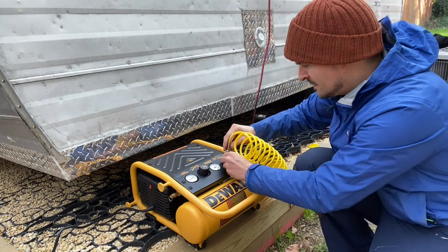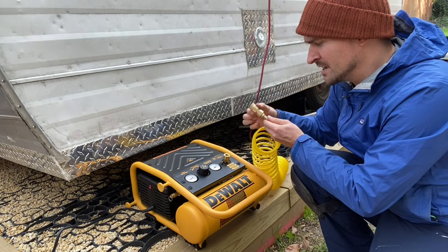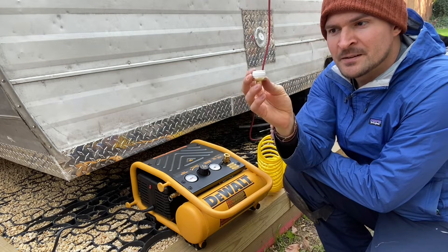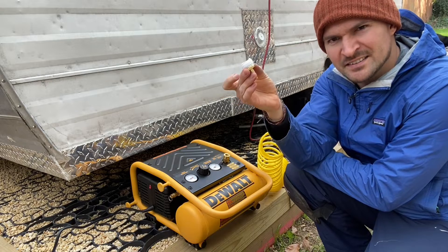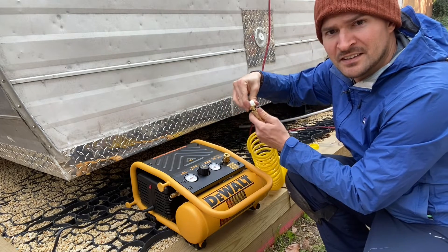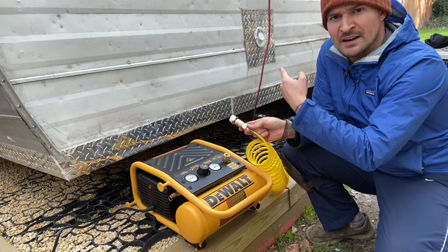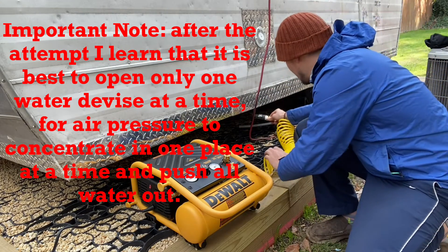The other end of the hose also comes with one of these adapters. For the hose you have to order separately this special adapter for the hose thread. I recommend you wrap it with thread sealant — it's a tape that looks like a rubber band and makes the seal more tight when you tighten it in. It also comes with the hose. The same way as before, you attach this piece — boom — and then make sure you open up all your water fixtures inside, so that when you start pushing the air, everything starts going out from all the faucets and the shower.